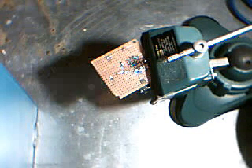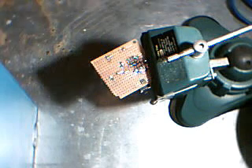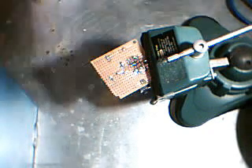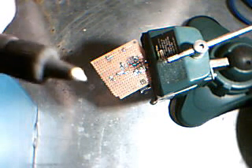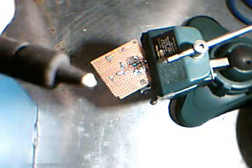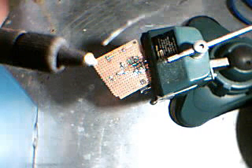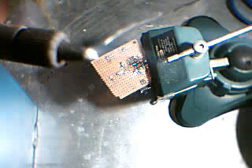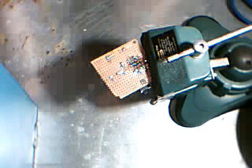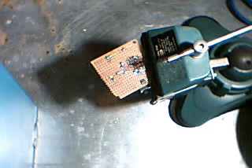Here's the first part of soldering. First, you want to turn on your soldering iron — it'll take a few minutes to heat up. After it's heated up, you hold the soldering iron like this. This is a three-year-old tip; I've sanded it down so many times that I totally need a new tip. What you want to do is take the solder and tin the tip — put a little tiny bit of solder on it — so solder that you put on there will melt easier. Then put it in your stand.